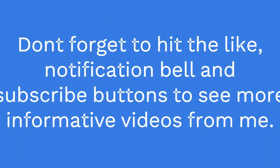The purpose of this video: if your cuckoo clock, or clock in general, if the cuckoo or the chimes on a regular clock is playing too fast, more than likely it's because the governor band is loose. And the purpose behind this video is to show you how to tighten a governor band up.